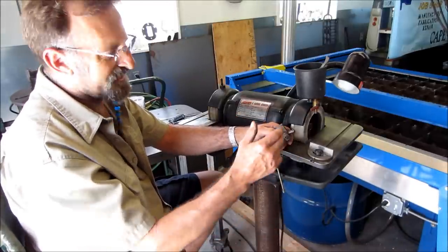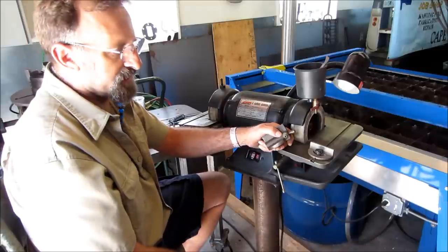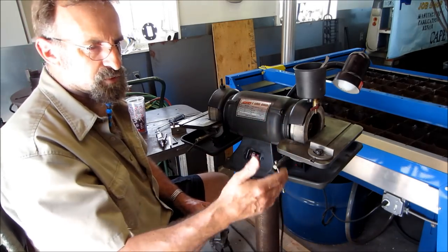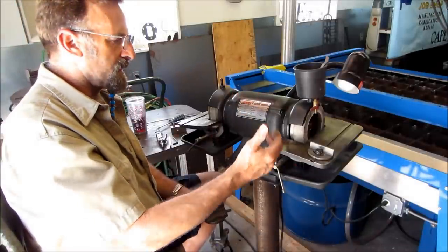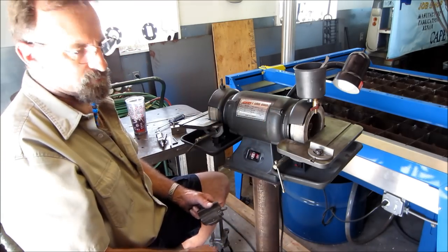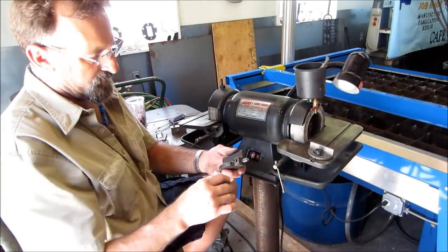You're grinding stones, some of them get pretty expensive, and they're a consumable item, but they are your tool, and instead of being a high-speed tool bit, it's a tool that creates sharp surfaces or grinding finishes onto different items, whether it be a tool post grinder or a cylindrical grinder or a centerless grinder, a drill sharpener, or a tool carbide grinder or high-speed tool bit grinder. All right, but anyway, back to the guide here.